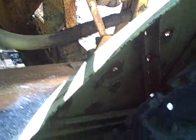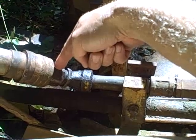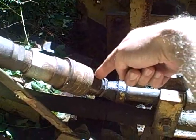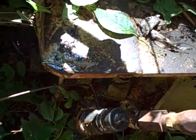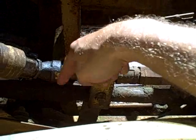Normally if I wasn't taking this coupling off completely it would be easy to figure out, because obviously this female end is going to go onto this male end right here. This pipe diameter is clearly bigger than this pipe diameter, so the small pipe diameter must be the pressure side and the larger pipe diameter must be the return. Over here these look about the same, but this one is reduced down, so this must be your pressure side and that must be your return.